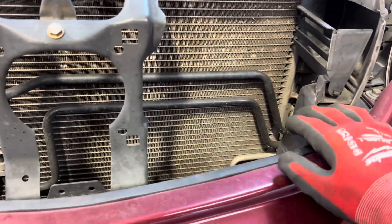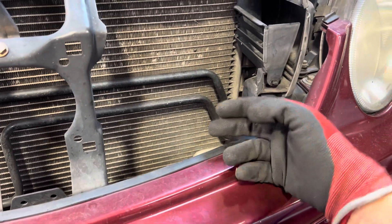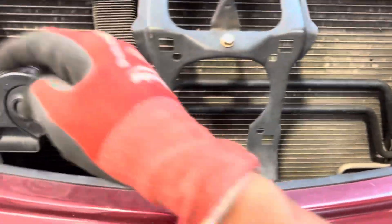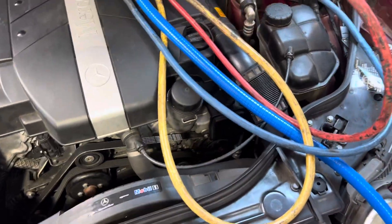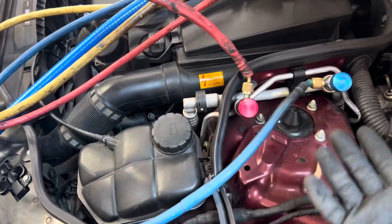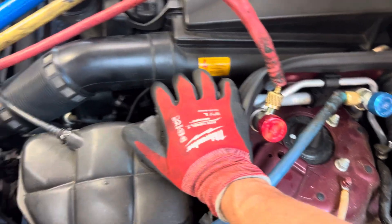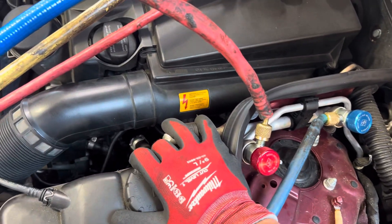You'll see it go across and drop down again to another point — say 10 tubes going across, but the bottom tubes are usually the ones that are blocked. By that time the condenser has usually filtered out the majority of particles and you don't see that repeat again, though that's not always true. This is where I get paid to burn up compressors on purpose, so to speak, because it's the shop's choice.